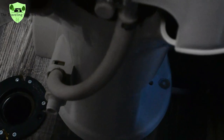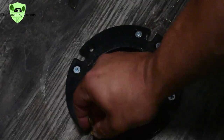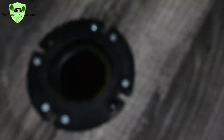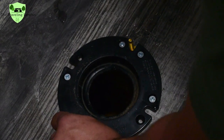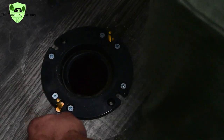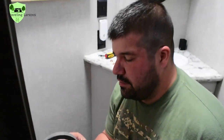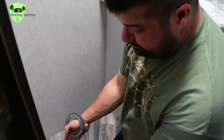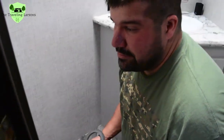I'm going to pull these old studs out — they just basically lift right off, they just slide out each side. Then I'm going to slide in these new studs. The only reason I'm replacing them is because I like new ones. They don't always go in very easy. We're good with these new studs in place. We're going to go outside and install the new flange on the new toilet, carry the toilet in, bolt it down, reconnect the supply line — less than a 20-minute job.